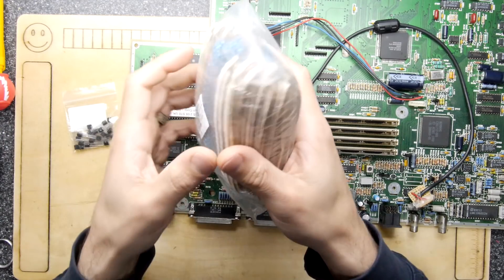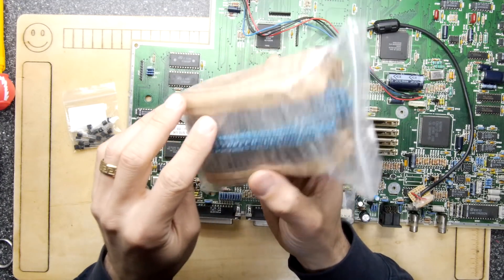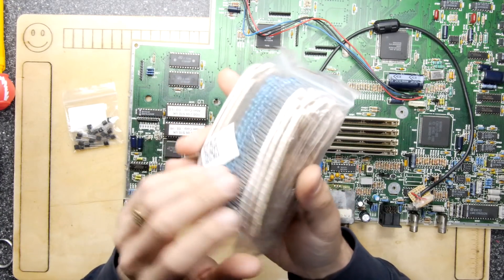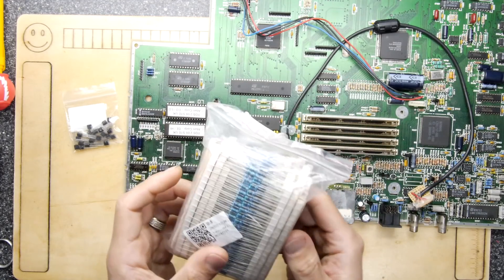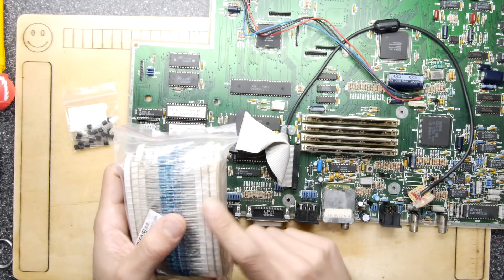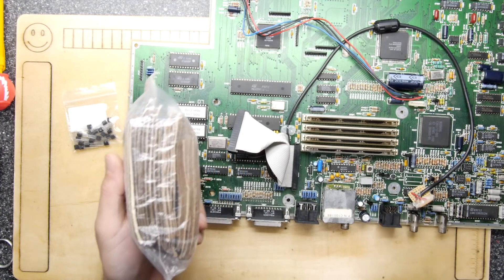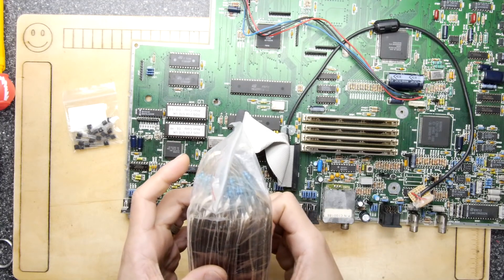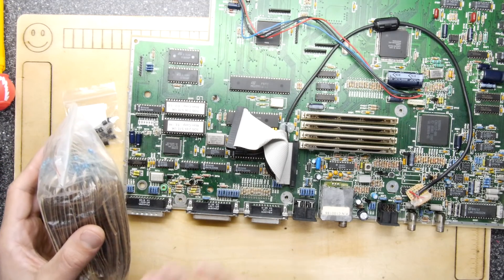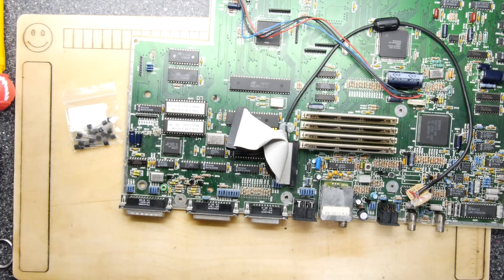While I was at it I also bought a whole bunch of resistors — every value from about 68 ohms up through larger values in certain graduations. When you buy these packs, make sure they have the ranges you want, because there are hundreds of values of resistor. You want the most common ones, but if you need a specific value make sure the pack goes up in the right number of steps — if it jumps by thousands you might skip over ones you need.